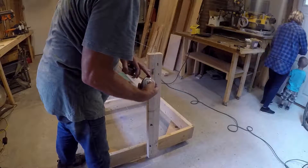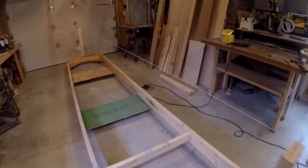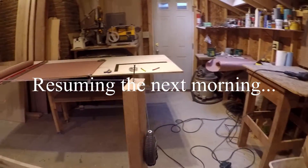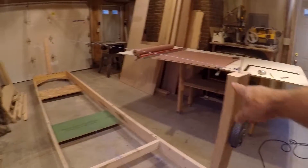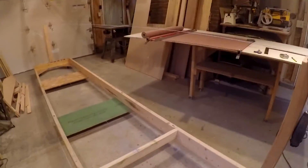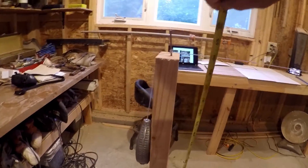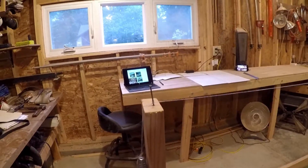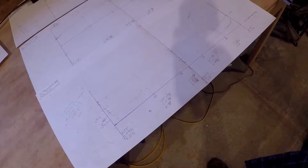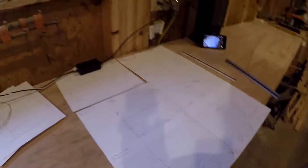There is our strong back with the reference lines above and below, corresponding to the top line on the drawings. These uprights are a little taller than before — I realized I had used some pieces that had been repurposed during the last build and cut down a bit, so I double-checked the height. Yesterday when I finished putting these posts up and the lines across them, I didn't have sufficient clearance, so I took them down, put up a new set, and re-plumbed the two reference lines.